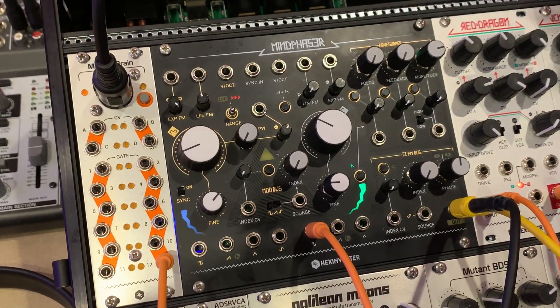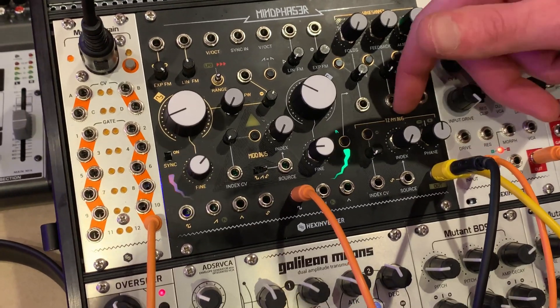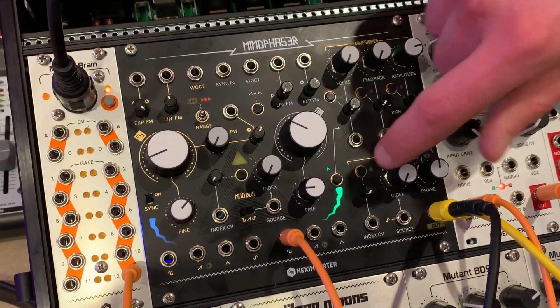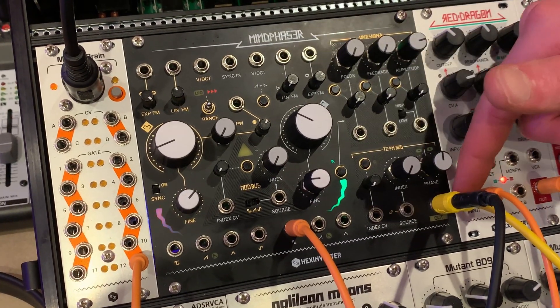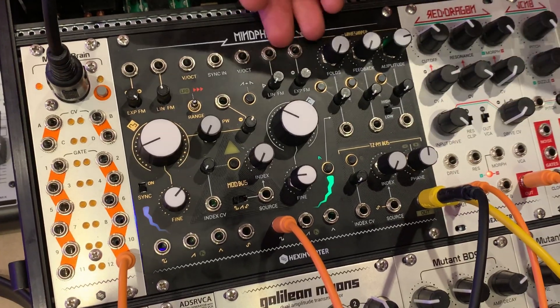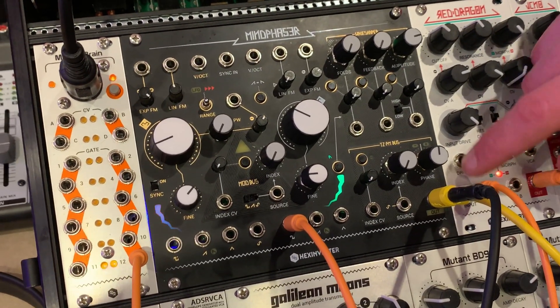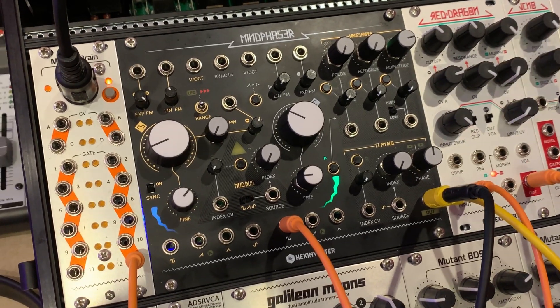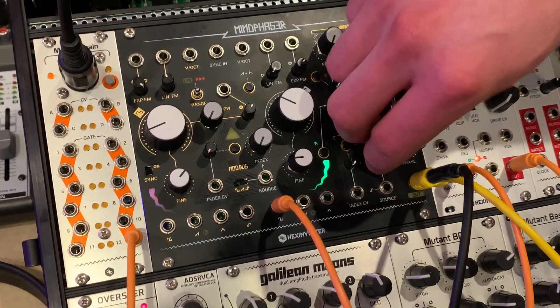Combining, or OR-ing, or doing different things with it — what I mean by that is, if you phase modulate and you look at the waveform from the VCO itself, not your final output, you don't actually see the VCO itself phase modulating. It's just the output here. I'm not doing anything too musical; I just wanted to give a feature walkthrough.